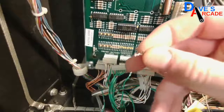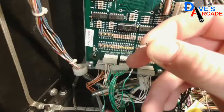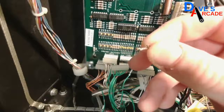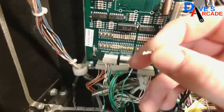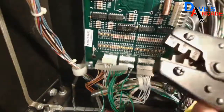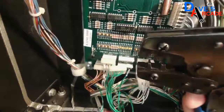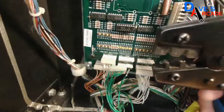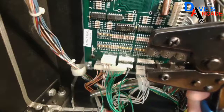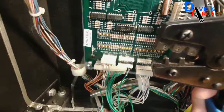On this connector you can see there are two fins. The outer larger fin on the end crimps onto the insulated jacket of the wire, and the inner one crimps onto the bare wire — that's how the connection works. This ends up sitting in the dies of the crimp tool, and there's a higher and lower crimp spot, so it pinches the casing less than the wire itself. You have to insert your connector in the proper direction in order to get it to crimp that way.